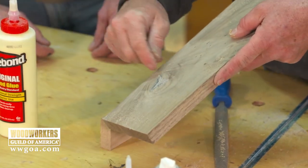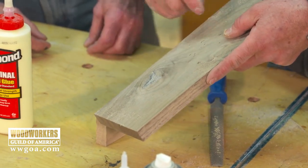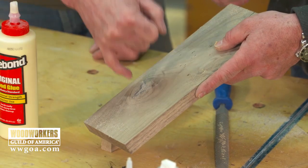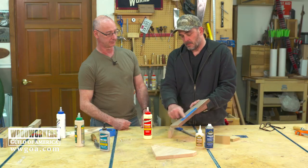And if you need to fill it in more, now that we've dug into our shell of CA glue, it's a little bit light, we'll just get it back to the right color. And what a great save, because I don't mind having the knot in my project, but I probably do mind having a hole. That was actually a hole all the way through. Yeah, I would mind having a hole all the way through. We just put some packing back and built a dam.